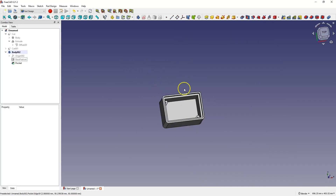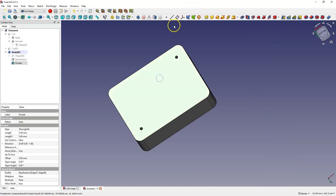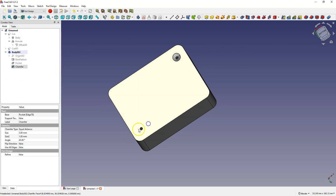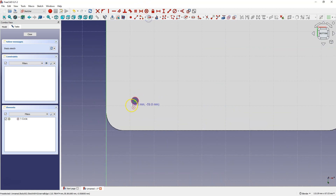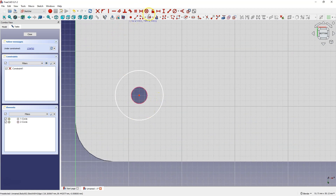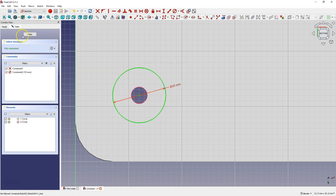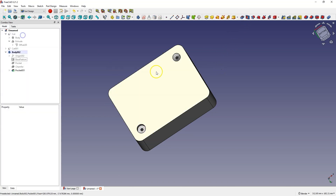If necessary we can also create a sketch here. We can either add a chamfer — I will add a chamfer on this hole — or we can add a new sketch. I will use this geometry as a reference geometry and create a circle here where the center coincides with the center of this hole. Then I add the pocket operation. This is how you can approach the creation of these types of elements.